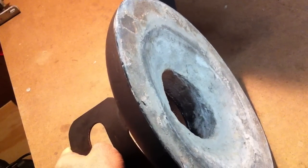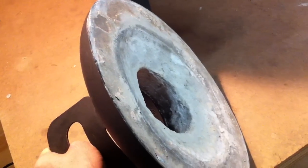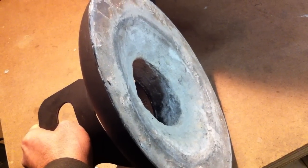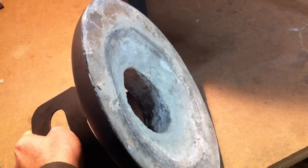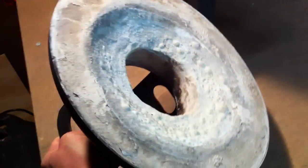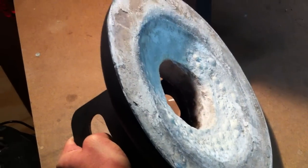So this is the lid, and I made it with this concave shape because I believe that helps with the airflow, creating the swirl. Because you want this sort of tornado effect inside your furnace, which will wrap around your crucible and be much more efficient in heating the crucible and the metal up evenly. So if you can see, there's sort of an indent shape.